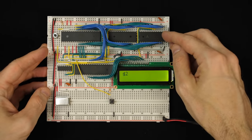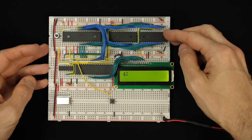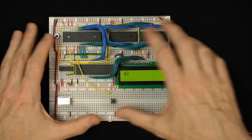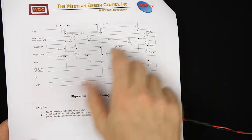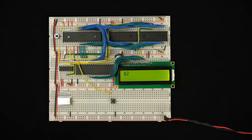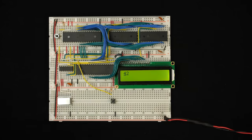The RAM we've got in our computer is not dual-ported — it's certainly not DDR or SDRAM. It's just asynchronous static RAM, which makes it very easy to interface with. But it does make it tricky to share with the video card. We could look at the timing diagrams, find room to read the pixel data we need, and buffer that somewhere — we probably could build some fairly involved circuitry to do that. But running this processor at 1 MHz, I'm not going to take that approach.